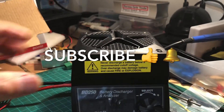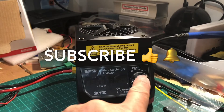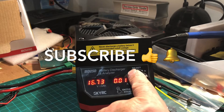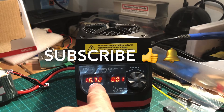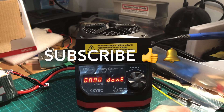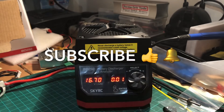I'm going to attempt a quick demo. I'll just plug this LiPo in now — it should light up. There it is, lighting up nicely. This is a four-cell pack. You basically multiply the number of cells by the voltage you want each cell to be — so if you want 3.8 volts per cell, times that by four — then set this unit to that number, press start. This pack is already drained to that capacity.